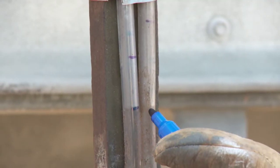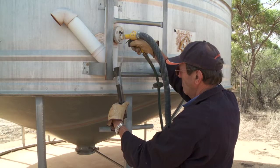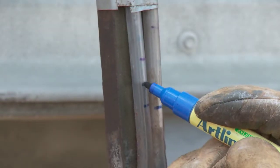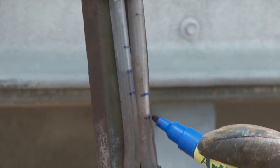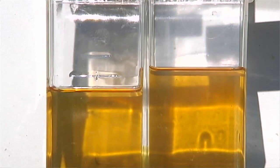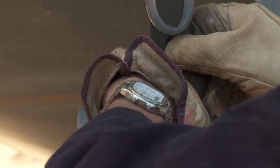A pressure test simply means compressing the silo to achieve a pressure difference of 25 millimetres of water gauge. This means 25 millimetres difference between the two halves of a manometer. A manometer can be as simple as a piece of food plastic tube, or it can be a factory manufactured visible oil pressure relief gauge. In that you can observe the 25 millimetre difference, then you time the decay period.